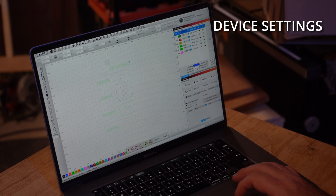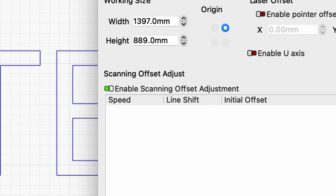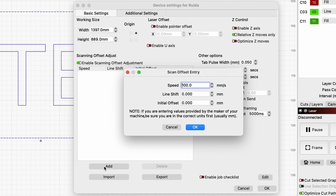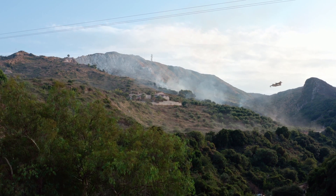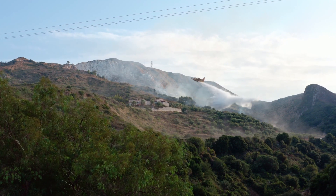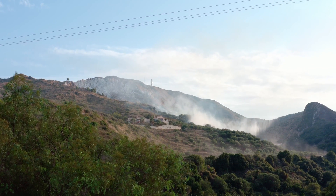Under basic settings, you'll need to enable the scanning offset adjustment, then just click Add and enter the speed from your first test. What we're going to tell the software to do is adjust the offset where the line starts and stops the engraving. Have you seen a plane dropping water on a forest fire? If the plane waited to drop the water until it was directly over the fire, it would miss much of the fire because it needs to start dropping before it comes to the edge. This is the same thing that happens with the laser — that's what we're adjusting.